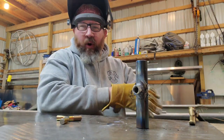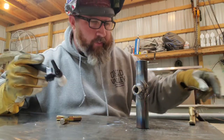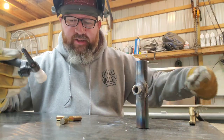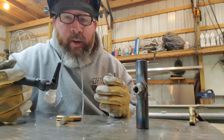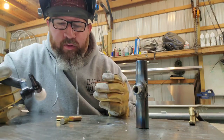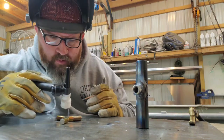I think that'll work out just fine. Go ahead, arc up, get it tacked, make sure it's the shape that we like, then go ahead and weld it. I'm jumping up to 90 amps on this one because I want this bolt to get hot enough and get molten quickly.